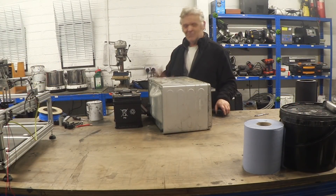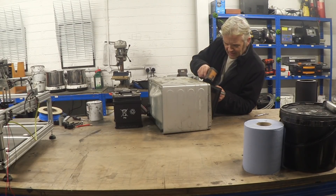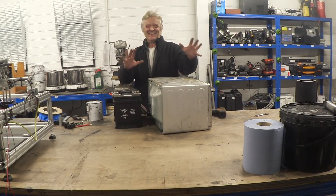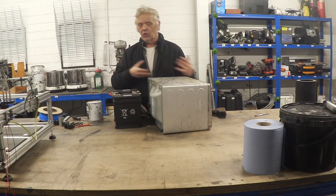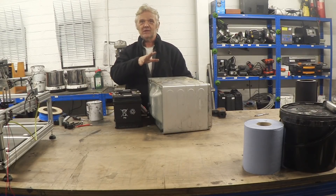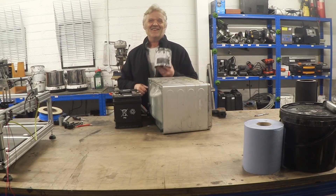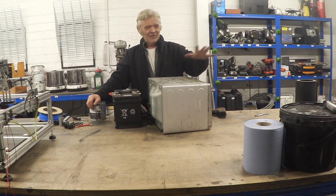Here it is almost finished — it's just missing the heat control — but this is stunning. That is 202 degrees in there! That's fantastic — 202 degrees on two car batteries. I tried it on one and couldn't get more than about 100 degrees, because heat was escaping faster than it built up. But it was absolutely astounding: it was only drawing about 5 amps at 12 volts, so that's 60 watts per battery — 120 watts total. It took about 10 minutes to get to 202 degrees, made with our conductive ink. It is indeed more than possible to make an off-grid RV oven.